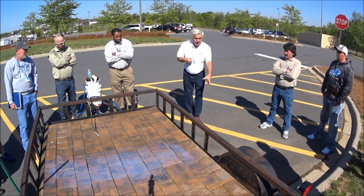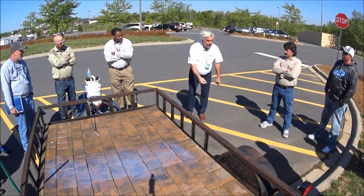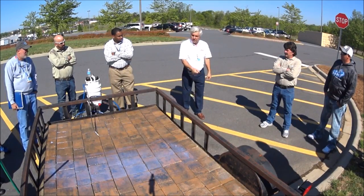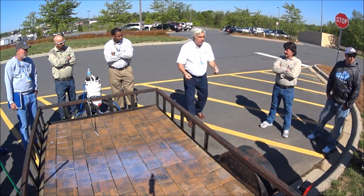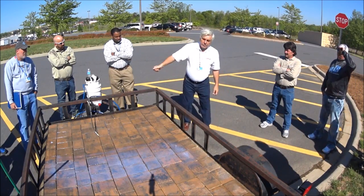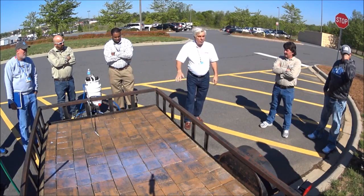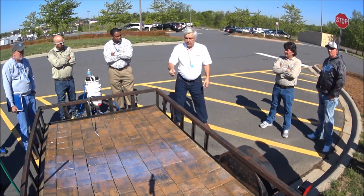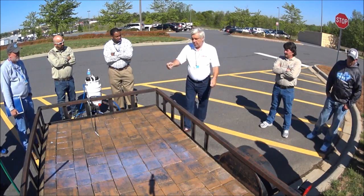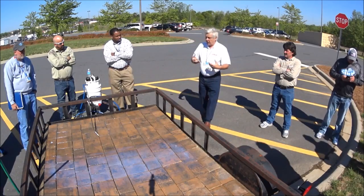Backpack, I got a pick on the end of my backpack blower. I scrape the joint. I don't have to bend down if I have high sand. So I'm moving around, I'm brushing, moving around, I'm looking at every paver. And while I'm sealing, I still got everything on. I got the motor running. And when I see something puddling, I got my blower, or if it's textured pavers, I'm blowing, I'm sealing. One time back and I'm done.